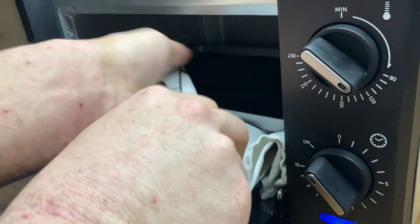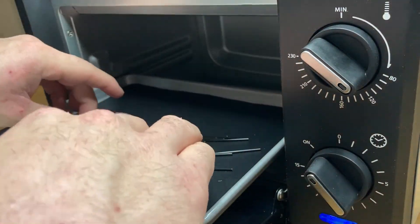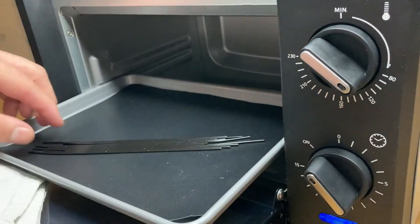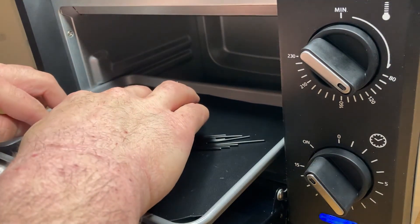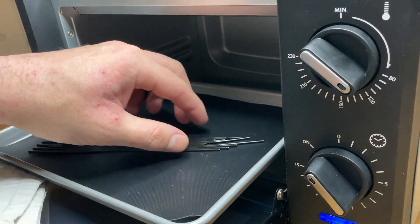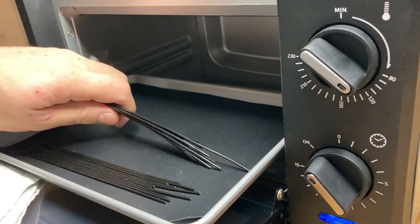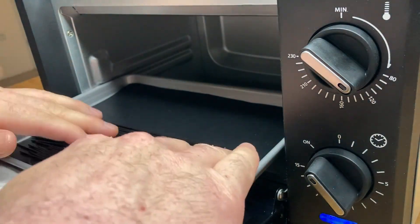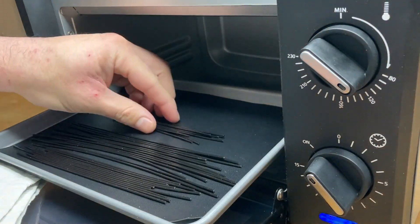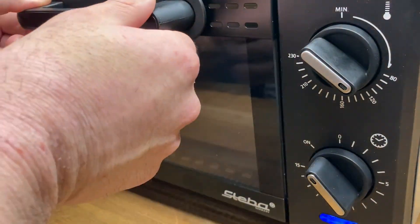So let's try 130 degrees Celsius again and directly handle it after opening the oven. This is the way to go — before the plastic cools off too much after setting up, you can still straighten it. The aim is to get to the highest temperature before the plastic gets soft and sticky. Straightening can of course be done multiple times until satisfied with the results.